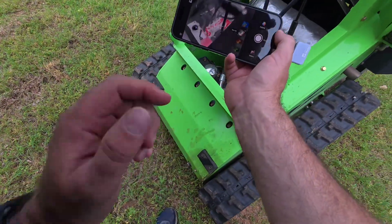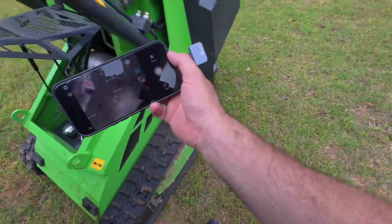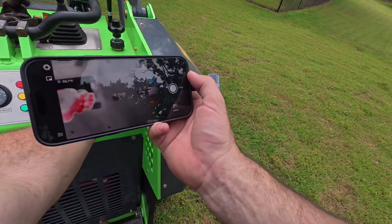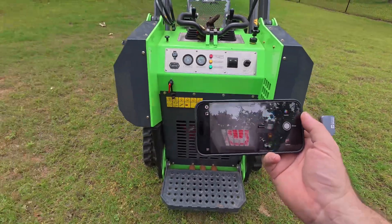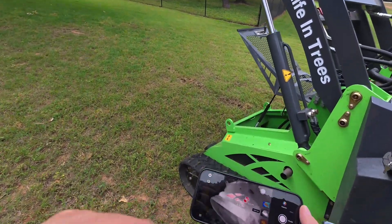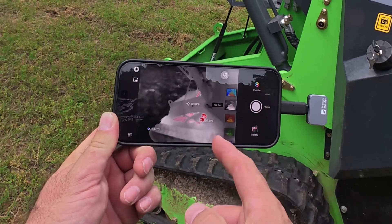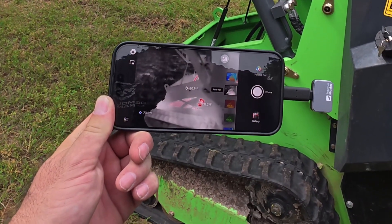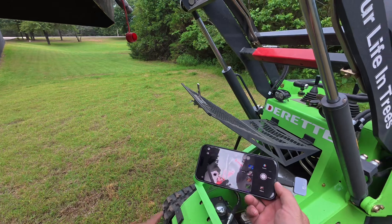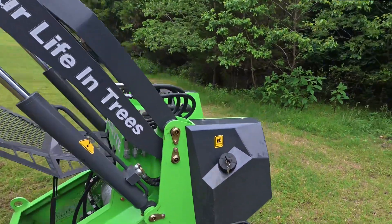Inside you can see the hydraulic pumps, and the engine's back there. That's the exhaust. Let's fire this up again. You'll see that exhaust will get really, really hot. The exhaust temperature is 108, 109, 110 — it's just going to keep getting hotter. Everything in here is going to keep getting hotter. See the hydraulic lines are all hot. Now we're at 130 degrees on the exhaust. Just keeps getting hotter.